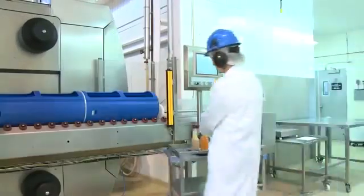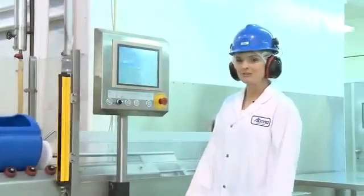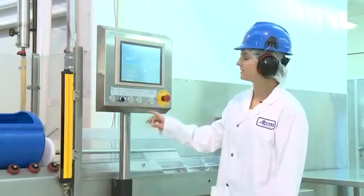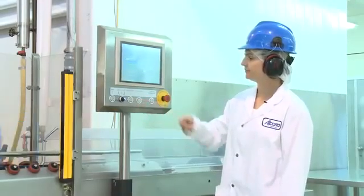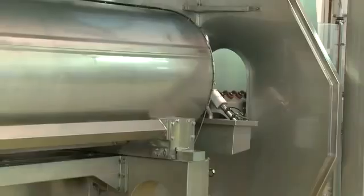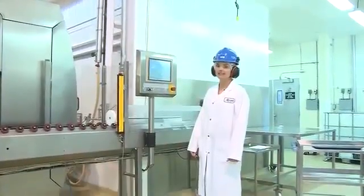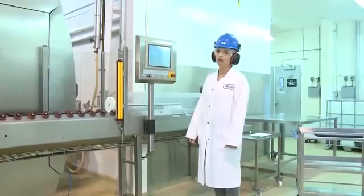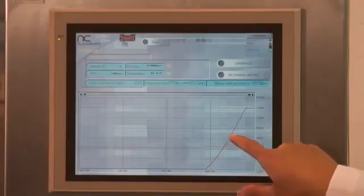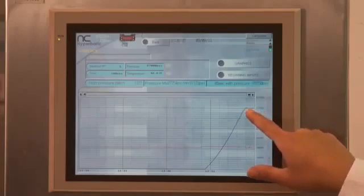Now I'll load a canister with our products. The machine is ready — the product is loaded and the green light is flashing, indicating that the cycle is ready to start. We'll press the button. The product gets loaded into the machine and the pressure vessel is moving into place. Once it's in place, the plugs will be placed in and the vessel will start filling with water. On the operator panel, you can track the increase of pressure — it goes up and is maintained at 87,000 PSI.